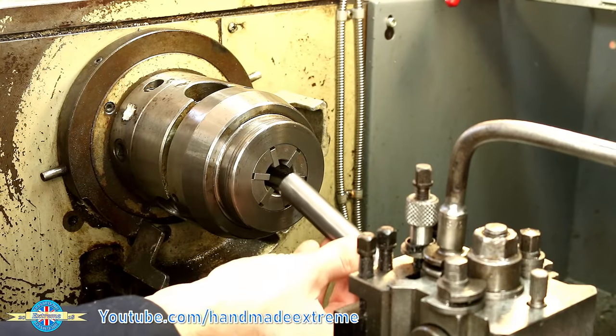For the roller I'm using some 38mm mild steel — I'm centre drilling it and then drilling it to just over 20mm so it's got clearance on the axle. I've machined up a small boring bar because my carbide tooling is too big for this, and I'm just taking a small cut out of either end so that I've got clearance for a bushing. It's just starting to grab so it should press in nicely. Putting it in using the fly press — and that's the first one. Flip it over and put one in the opposite end. Because I've used the collet chuck everything should be nice and concentric and in line, so hopefully when we put the axle in it should run nicely on the bushings. That fits in there and then the whole thing sits in the frame.